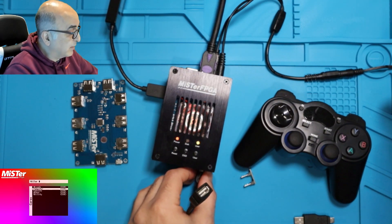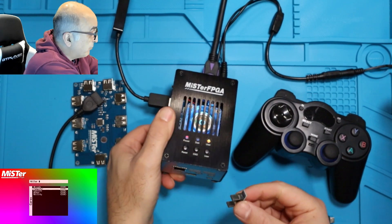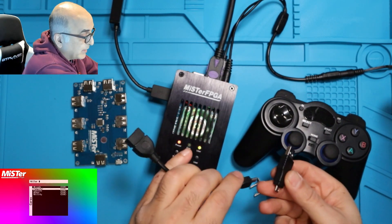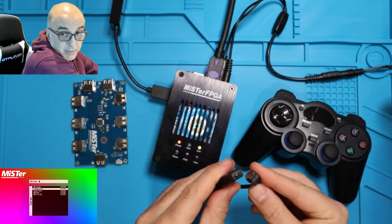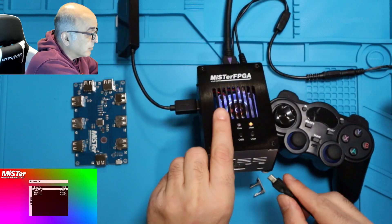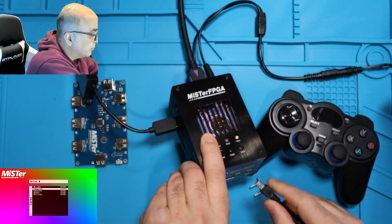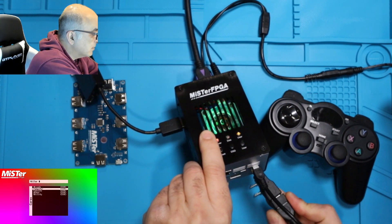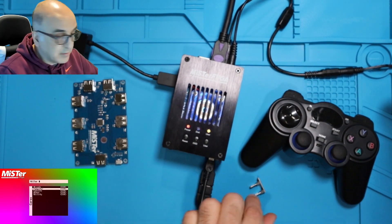If that works and your hub is not working, which means either your bridge is bad or the hub is bad. If the bridge is bad, that's the next thing you want to check. You can use the same cable I showed you and maybe an adapter, where it will basically be a micro USB to micro USB. Or you can just get a cable that's a micro USB to micro USB. Then you can use that as a bridge — connect one end to the DE10 nano and the other end to the hub. That acts as the bridge, and hopefully that'll solve your problem, meaning the bridge would have been bad.